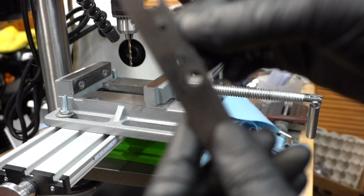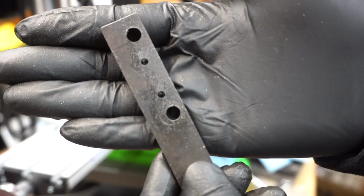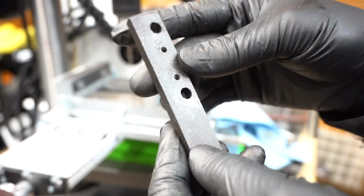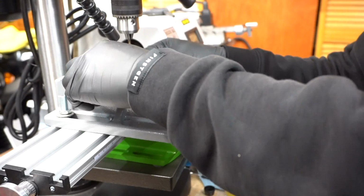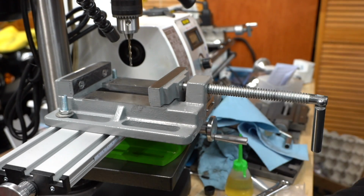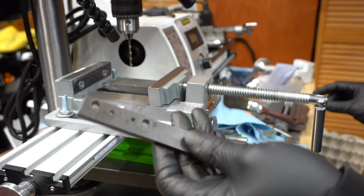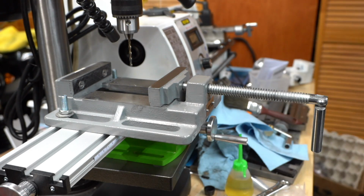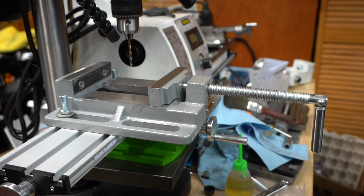So with this, the first one I went just under 1/4 inch, which was fine. The second one I went exactly 1/4 inch, punched through it. So guess I'll just do this by hand, and actually no, I don't want to do that because I could oval the hole. It's a bad idea. So we'll just leave it like that. So yeah, got our holes drilled. Now we'll tap it and mount the sensors on.